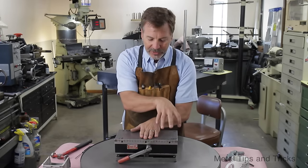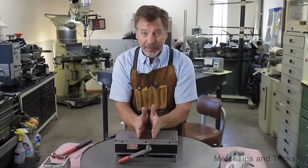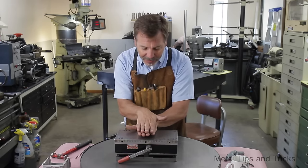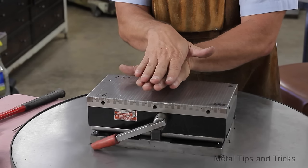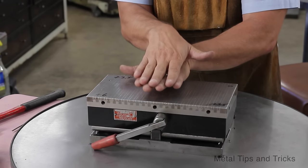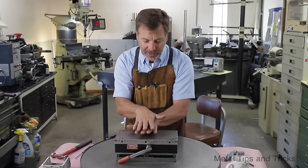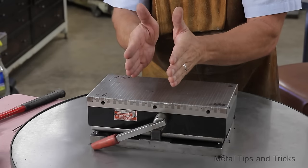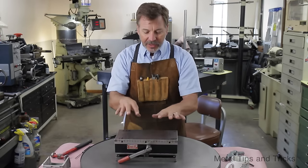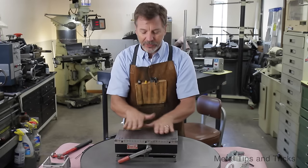With that sandwich of magnets below and a sandwich of conductive and non-conductive material on top, the magnet actually shifts from one side to the other. When it's shifted off, there's no magnetic flux allowed to come through because it's canceled out by the reverse magnets. But when it's in alignment, the magnetic flux is allowed to come up and grab your metal. Originally I thought the magnet pulls away, but no — it actually just shifts over.